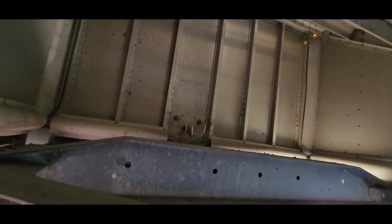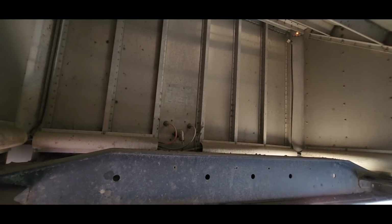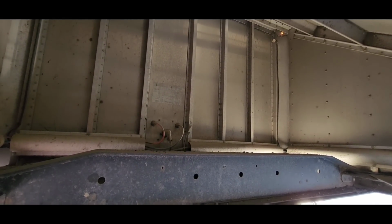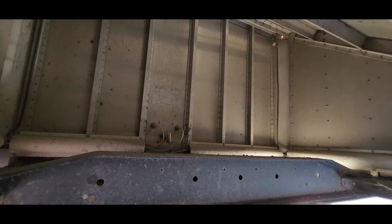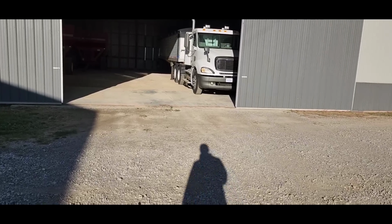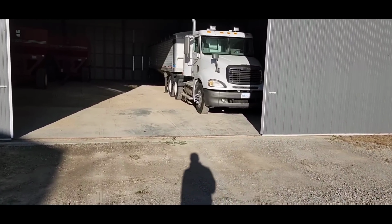But I believe there's an auxiliary power. Well, there's a wiring diagram up there too. There's an auxiliary power wire coming off the plug from the trailer. It's not necessarily tied to the lights on the trailer, so that's a good spot to do it. Okay, I've tracked down which pin has power to it.